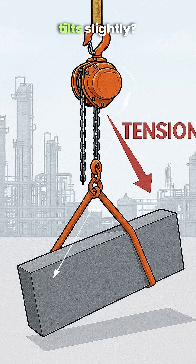But what if the chain tilts slightly? According to standards, a maximum tolerance of plus or minus 10 degrees is acceptable. Even then, the chain is forced sideways and the hook and pulleys experience more stress than normal. In short, usable, but the risk increases.